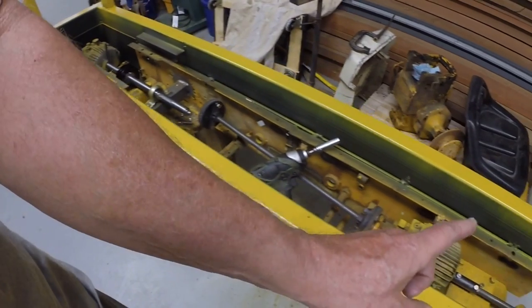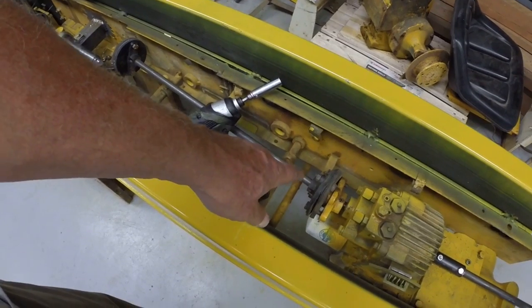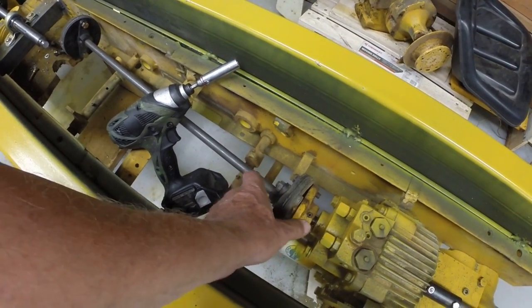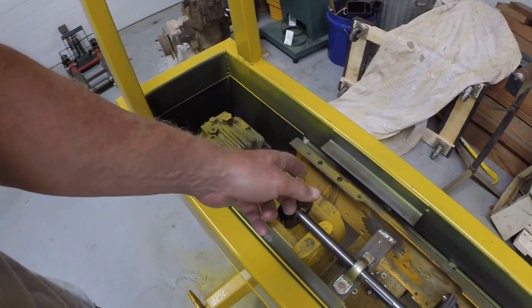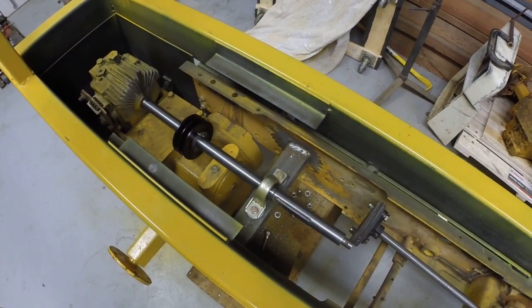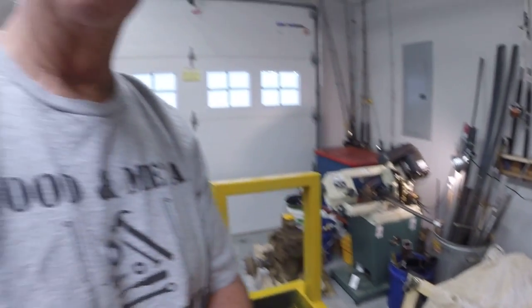Now, when this was the front, it was no problem. The engine would sit here, the crankshaft pulley would sit out here, and I put the drive pulley right here. Matter of fact, it would fit right here in the space of this flex adapter. When I moved it down here, I turned the engine around, and I was assuming the drive pulley would be here with the engine crankshaft facing rearward. Of course, that gives me the wrong rotation. Those engines turn counterclockwise, which would drive that clockwise and drive this one counterclockwise, exactly the opposite of what I need. I don't know what I was thinking.